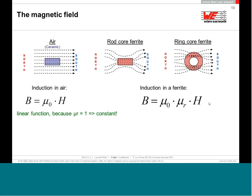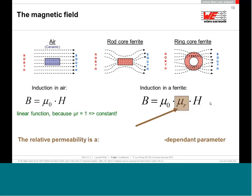For a ferrite core-based inductor, you have this initial permeability, also called relative permeability. And the point is that this is a very, very dependent parameter. This mu-R depends on material, frequency, temperature, current, pressure, and more. And now you start to hate inductors. It was similar for myself when I was a design engineer and had to use an inductor. I hated to use it in my design, but I must use it. Now I understand much more about inductors and I realize why I sometimes made mistakes.